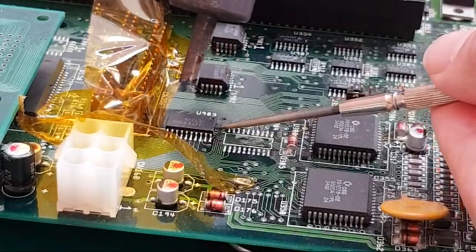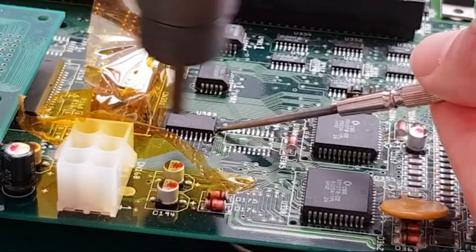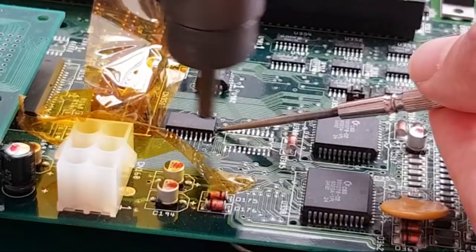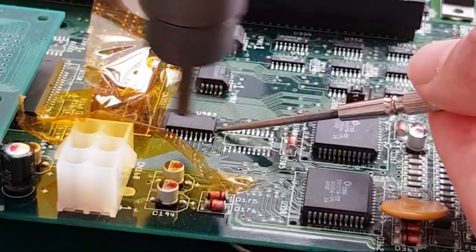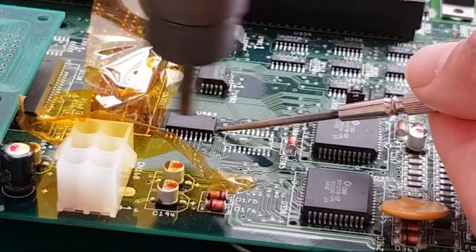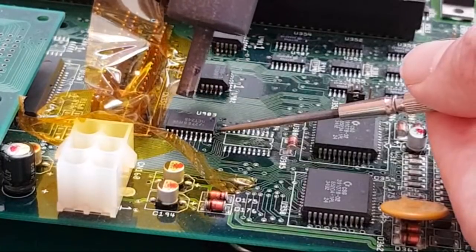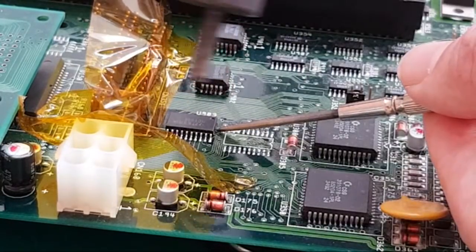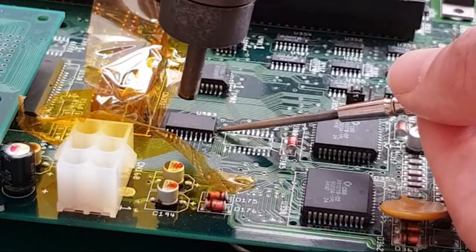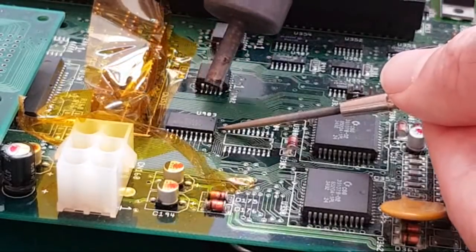It could be a bit of a cheat, because obviously there's going to be a proper protocol and a series of things that happen when the drive gets initialized. But sometimes with things like that, it can be more difficult. You might need more logic if you're going to try and do a proper handshake and follow all of those state changes on the different connections there. Whereas you could just literally poll the first two bits and go, well, let's wait for the high on the first two bits. If those go high, we've got a drive, and then we start communicating with it properly. It might be that simple. I'm probably talking rubbish, but